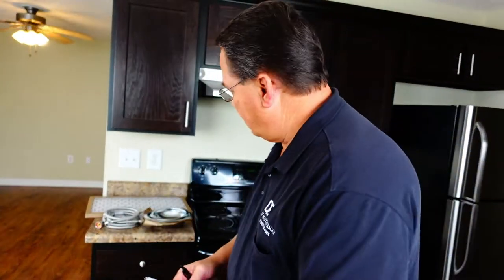Each room I go through and scan every wall for any issues. If I do find an issue, I write it down. When I'm done walking through the whole apartment, I'll go down to the shop, collect all my parts. I've got everything staged and ready to start installing. As I install parts, I take my list — say the stove needed drip pans — I line that off. Every time I complete a project, I line off that item, and at the end I go through the list to make sure everything's checked and done.